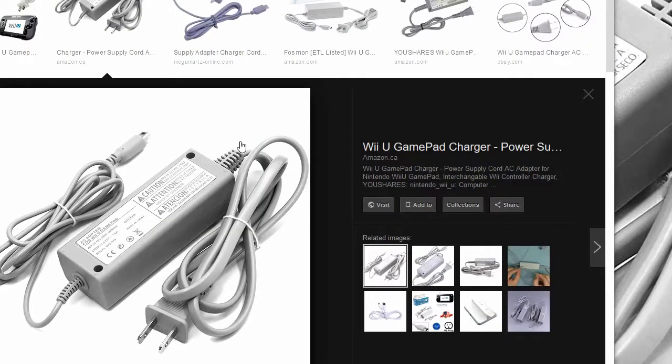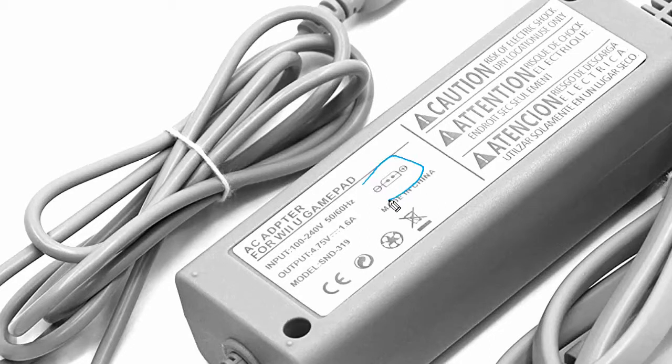So the first thing one does is have a look at the actual power supply. In my case, the most important element was the polarity of the plug — which one is plus, which one is minus. This diagram always tells you the polarity or pinout of the plug facing towards you. So if this one is facing towards me, the plus is on the right. When I plug it in to the controller, it will be on the left.